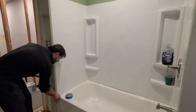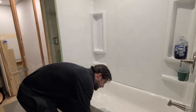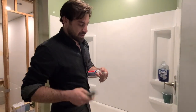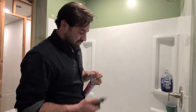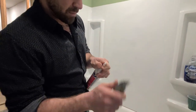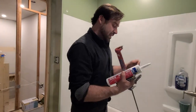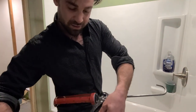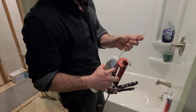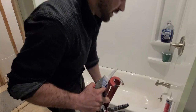There's one more thing that's going to help — a knife to cut your tip. Now, this is unrelated to the video, but if you're doing trim or something and you want to cut a super small hole, the caulk gun nine times out of ten ain't going to be able to stab it because you can't get in that tip when it's real small. So what you can do is take a piece of wire and use that when you have something real small.